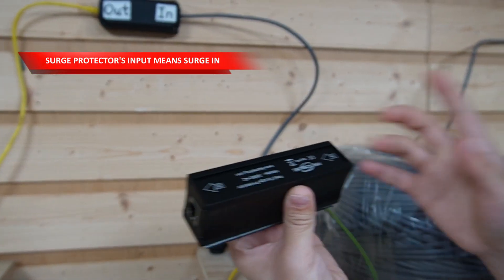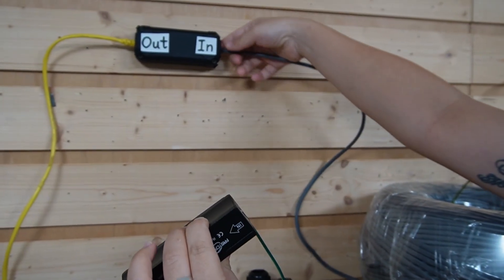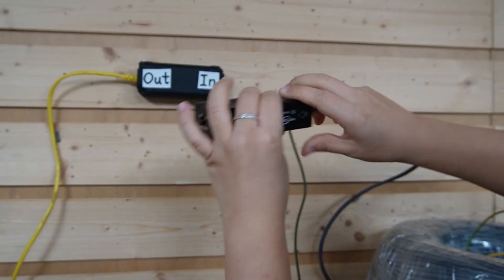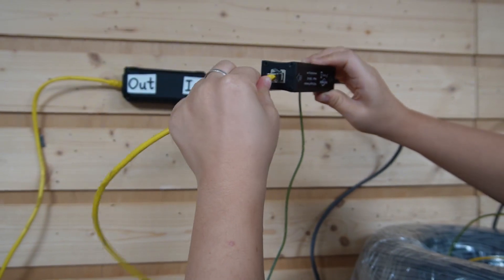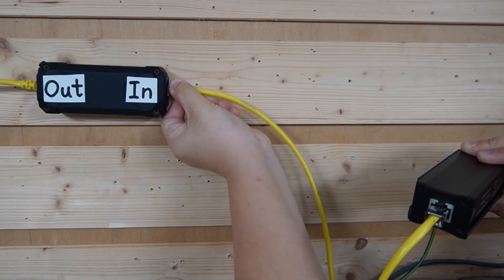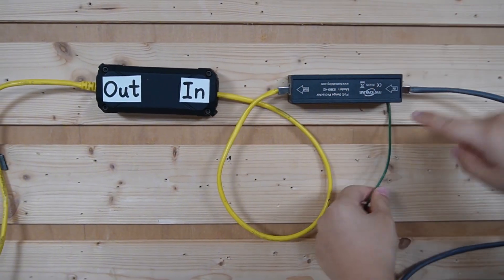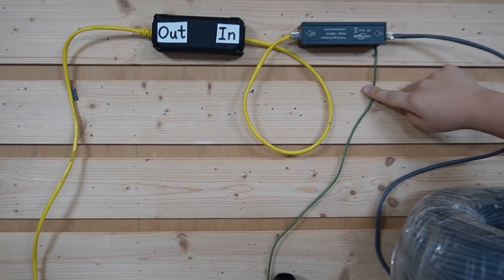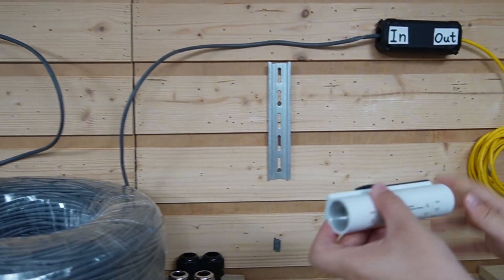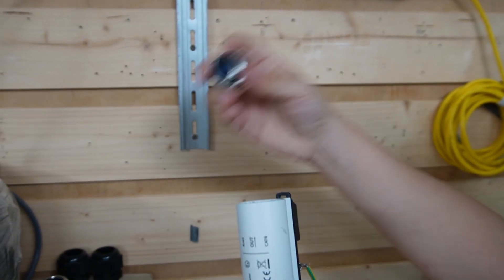One thing is we have to face the input port toward our long cable. So I am going to unplug our 300-meter Ethernet cable and connect it to the input port of our indoor surge protector. Then use another short patch cord to connect the output port, so we can have clean power directly back to the input port of our first extender. Make sure you ground the surge protector. Another surge protector goes next to our second extender — this is our outdoor PoE surge protector, which is IP67-rated.